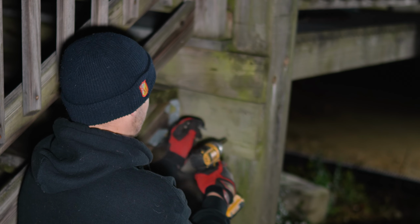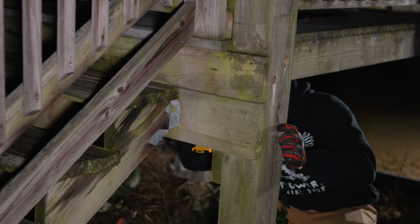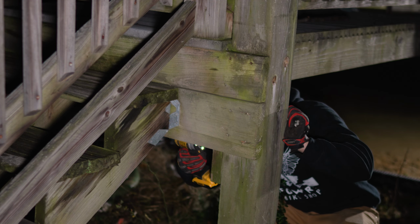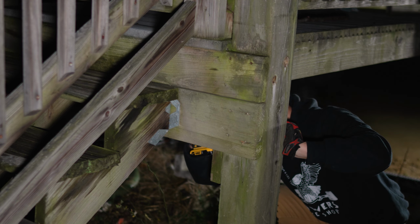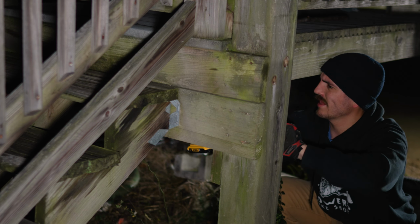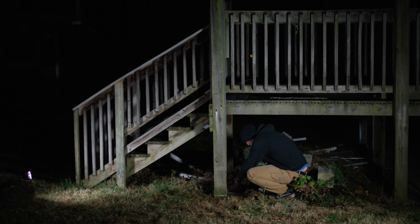The 6x6s are gonna be the outermost supports for the woodshed, with 2x4s going from the 6x6s attaching to the 2x4s against the wall inside the garage. And that'll be the kind of lean-to style roof that I'll be using. I'm gonna try and use mostly wood that I have here, so I don't have to buy too much.